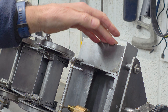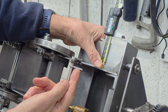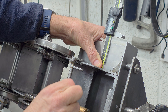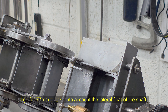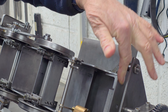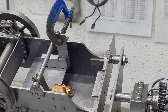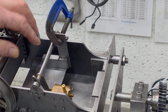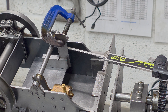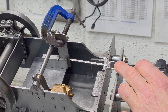So 16.5mm will work for that, and I can take the dimension from the outside of the frame to the outside edge of the running plate — 61.5mm. I need to remove half the width of the lever arm, and there's a good millimetre or so of lateral play. That gives me 75.5mm from the outside edge of the running plate. I also need the distance from the rear face of the buffer beam to the centre of the slot in the lever arm — using a small square clamped to the lever arm and vernier calipers to find that distance: 73.6mm.